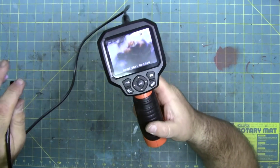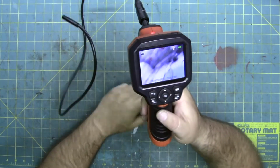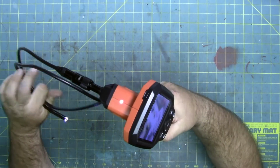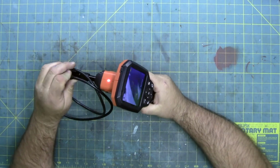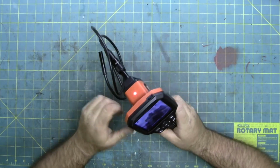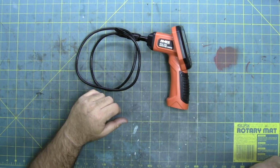So, with a lot of perseverance, and that I don't want to give up and have something inanimate beat me at doing something, I was able to repair the pin on an inspection camera that was purchased at a pawn shop that was not inspected by a friend of mine. And I'm going to tell you one thing: if you need to do something similar, I'm not going to envy you. But take the set screw out of this side, the camera or camera and light side, and pull that center piece out and remove the collar. That made life a lot easier.